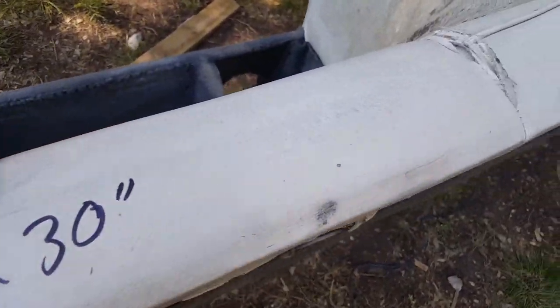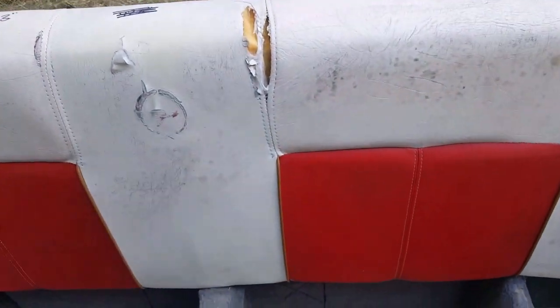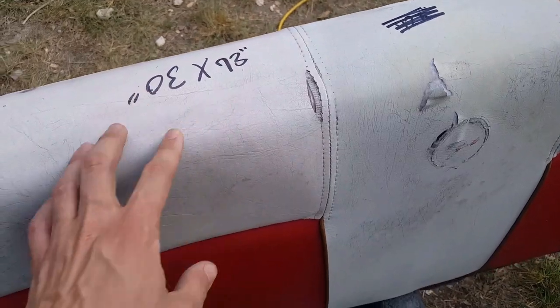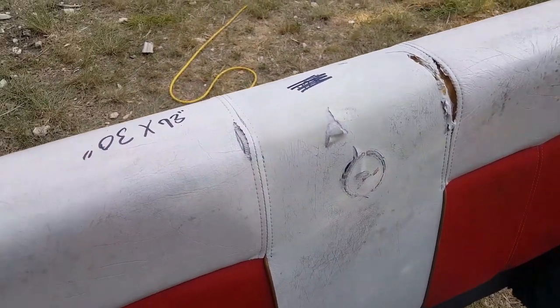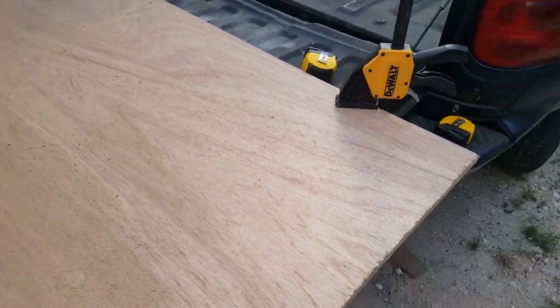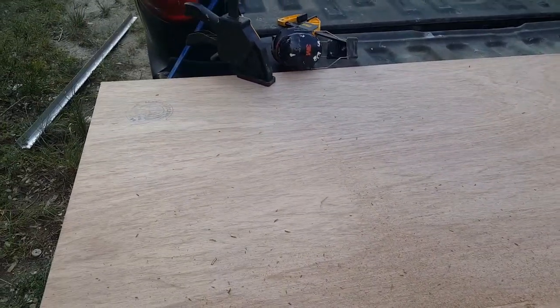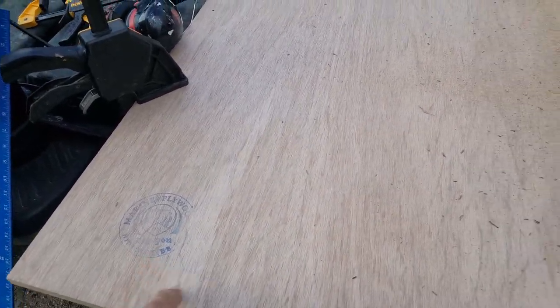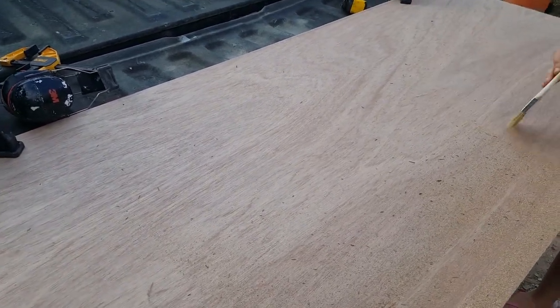Initially this thing is about 69 inches wide from side to side. What I'm actually going to do is go from 69 inches to 73 to give us a little bit more real estate side to side — that's going to be helpful. Our back piece here is 30 inches wide. So we've cut our 30 by 73 — this is the backboard. As you can see, HydroTech three-quarters is what we're gonna end up using here. Next thing we're gonna do now that we got the backboard cut is go ahead and try to capture those side pieces so we have an idea what that's gonna look like.